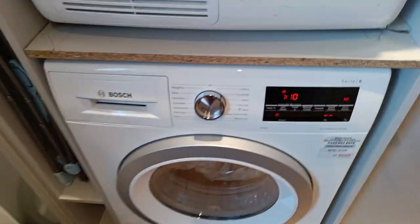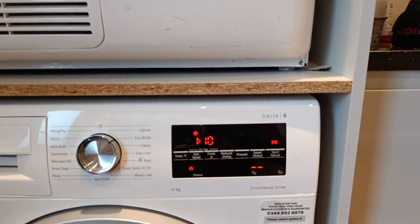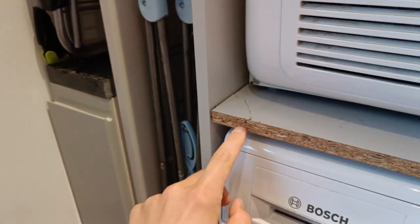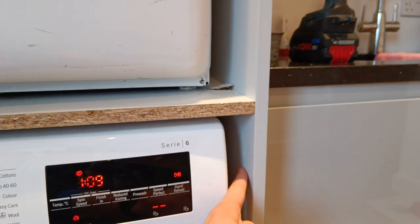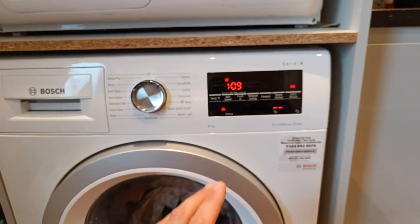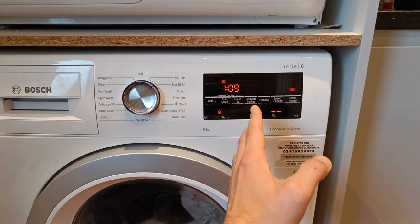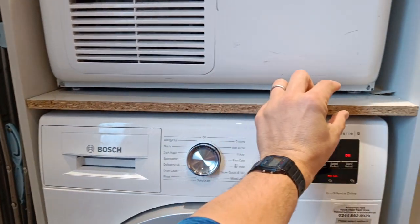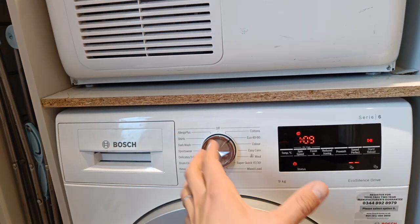Right, the washing machine is going basically. I built this housing and I forgot to get this front edge the same as that — I just got it wrong basically — and then when I was installing it the screw went up at an angle and busted this one, busted this one, which I then glued back in place, and then the weight of this is just crap basically. I put L brackets underneath and supported it, it's just not strong enough. Also, one other thing I can solve — a problem which I hadn't realized — is when this really gets spinning it actually travels across slightly, so what I'm going to do is put a block down here and a block down here to support the weight of the timber and the unit, and that'll actually help hold this in place on either side so it doesn't travel quite so much.